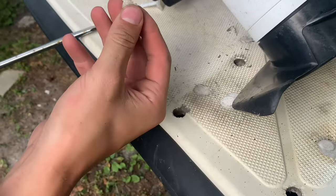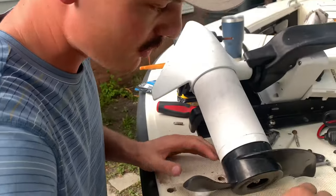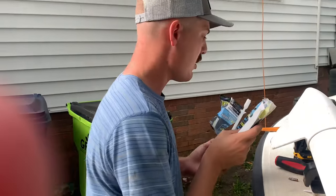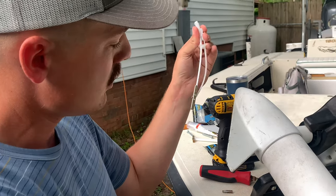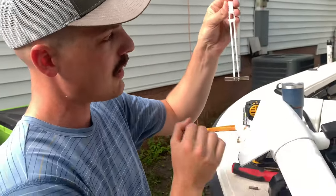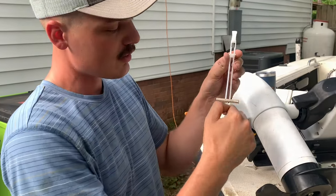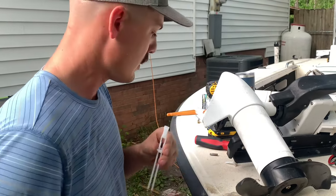I'm sure there's easier ways to do this, but this is how I'm doing it. Now we're going to get our new gear out, get it ready and staged, and I'll show you how to set them up. When you go in the hole, you can pull one of these up and push one down — this is going to allow it inside the hole. Once you get down in the hole you're going to straighten it out and pull this all the way down, and that's what brings the metal plate all the way up underneath the deck. You'll put your bolt in there, and it will sandwich together with the bolt to create a nice tight grip.